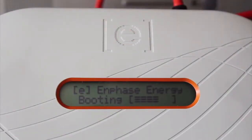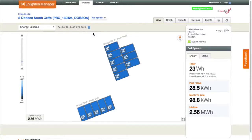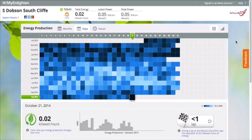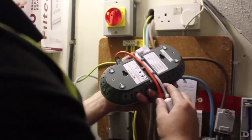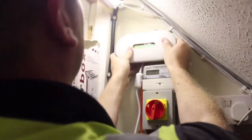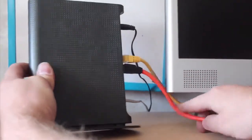The Envoy is an essential part of the Enphase micro inverter system. It operates between the micro inverters and the Enlighten web-based monitoring. The Envoy functions as a gateway, collecting energy and performance data from the micro inverters through the home's existing AC household wiring, then forwards the data to Enlighten via the internet to produce reports on the system. Installation and operation of the Envoy require no specialist equipment or computer or networking experience. The Envoy simply connects to the home's router, which sees it as another device on the local network, much like a personal computer or smart TV.